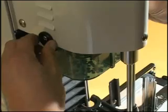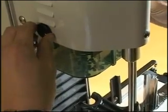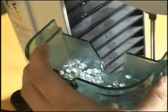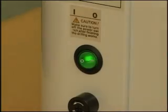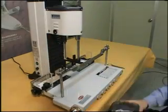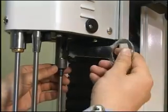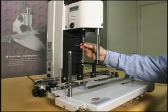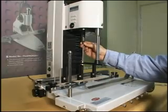When the chip box gets full of chipped holes while processing, turn the screw and detach the chip box to throw out the chipped holes. When replacing a drill bit, first turn off the power and dismantle the chip box. Then use a hexagonal spanner to dismantle the drill. Turn the new drill into the adapter of the shaft and push upward.